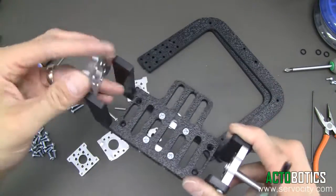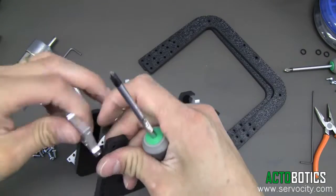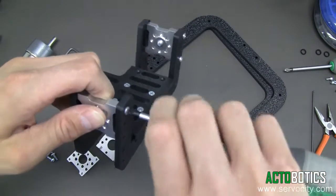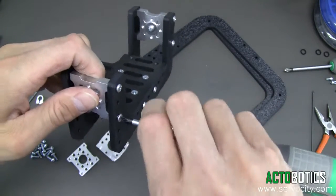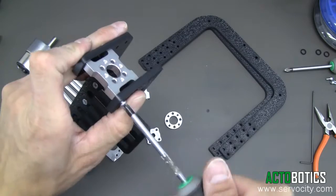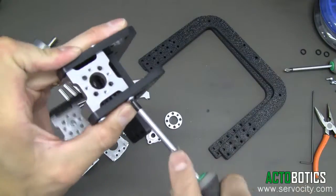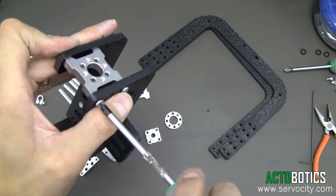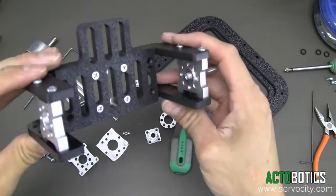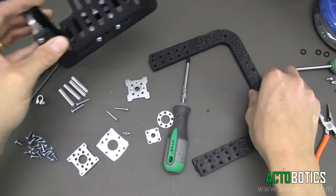Now we want to put the other unit on the other side. Put that in between the plates and bolt this one together. Both of these are the same on either side, so you don't need to orientate them at all. Tighten that down and just double check them. And there's the inside cradle. In the next video we're actually going to show you how to assemble the outside cradle.